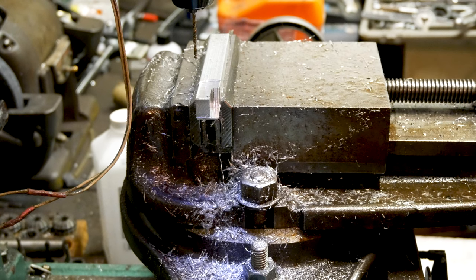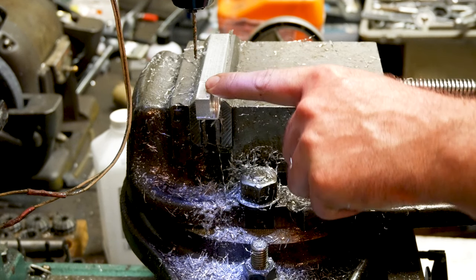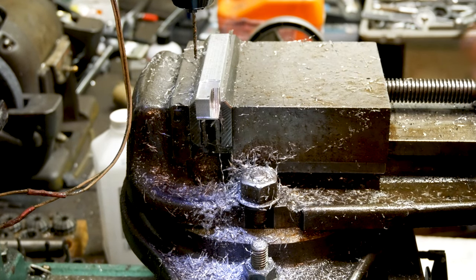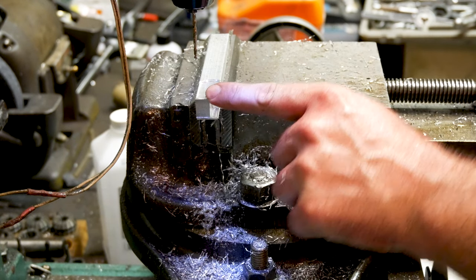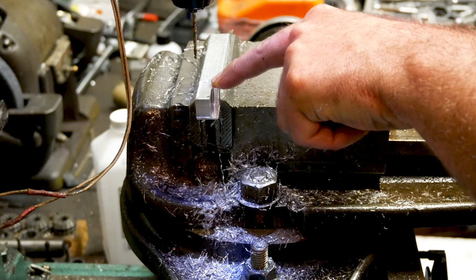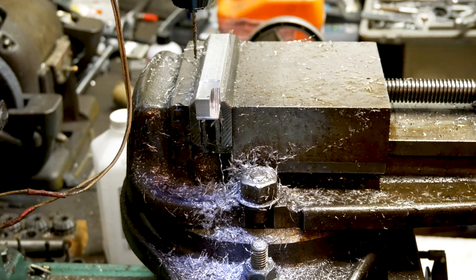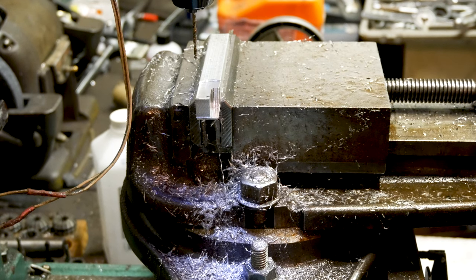roughing it again. Well, I said it's 0.71 to the other side. That was 0.1475 or 0.15. So you're talking about 0.55 left from the center of that to this end wall. So you go 0.15 off of that roughly, and you have a difference of 0.4. So you're going to run 0.4 and then my error plus 0.025 to get down to where I need to be.